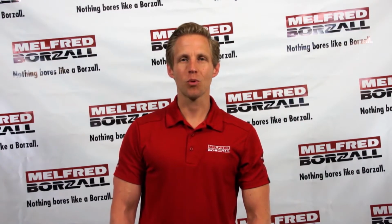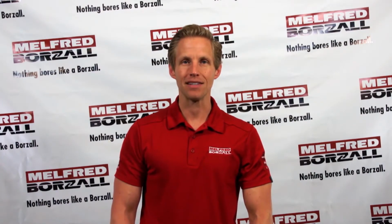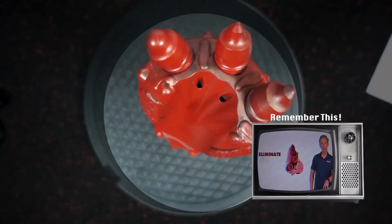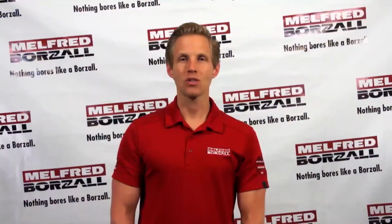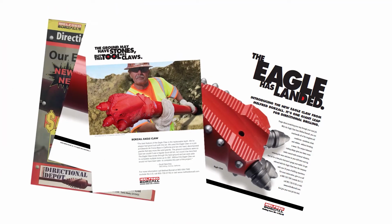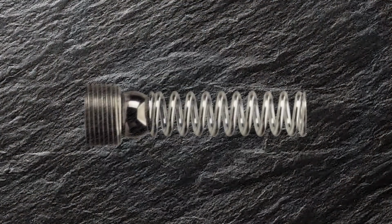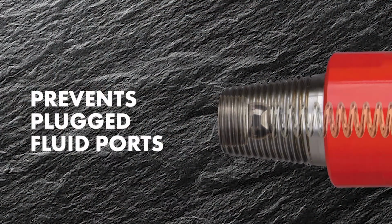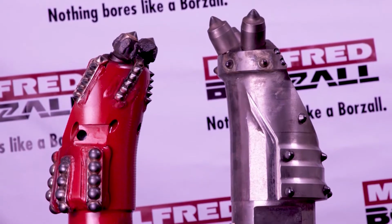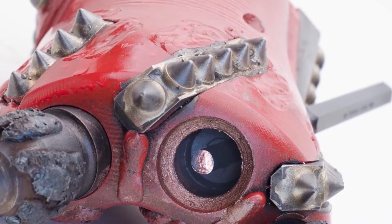My name is Josh with Melfred Borzall, and today we're going to be talking about the newest generation in HDD's most trusted bit. The original Eagle Claw was the first to introduce a balanced cutting design that prevents vibration up the drill rod. But as drillers encountered increasingly difficult hard ground conditions, we made improvements to the Eagle Claw to meet those demands. For example, the check valve was a revolutionary improvement to hard ground bits that helps prevent fluid ports from becoming plugged. Later generations of the Eagle Claw introduced increased wear protection and contouring to the profile to reduce drag on pullback, and also straight through cutter knockout holes for easier removal of the cutter teeth.